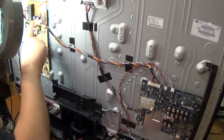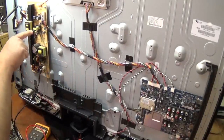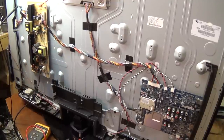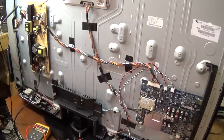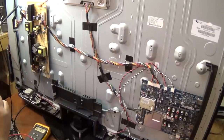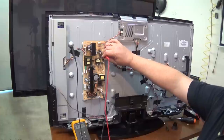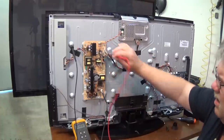This is our standby supply right here — this will be our standby transformer right here that I'm putting my finger on. Yes, I'm touching the transformer, it's 3 volts. This is probably the regulator. I've got 3.3 volts here, so that one's working. I've got 3.3 volts coming off my diode here. As you can see, our 3.3 volts is now present on the set.